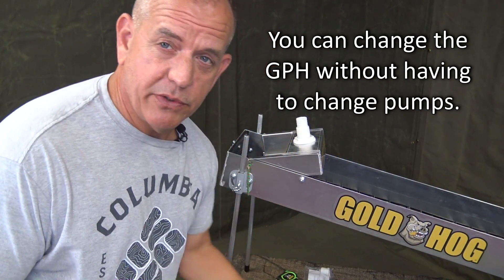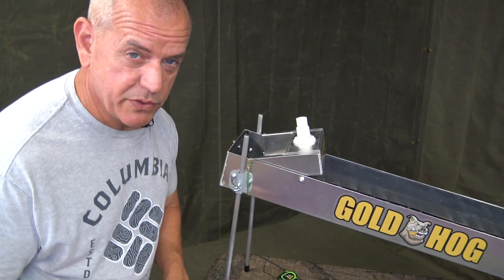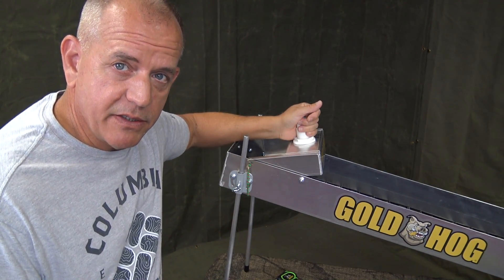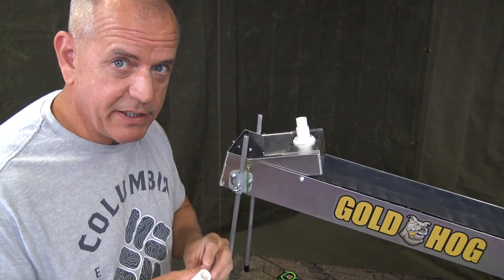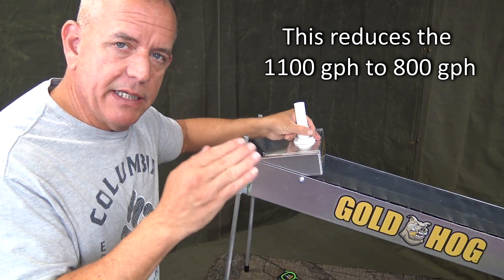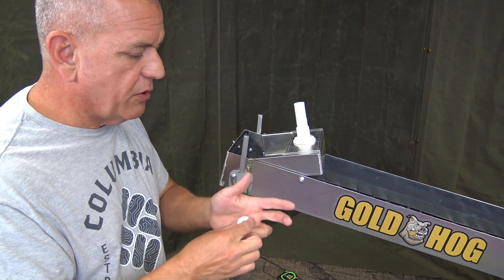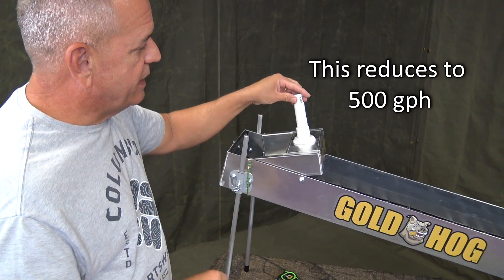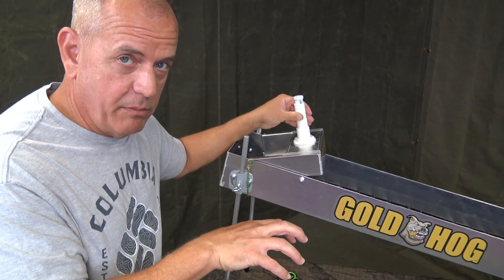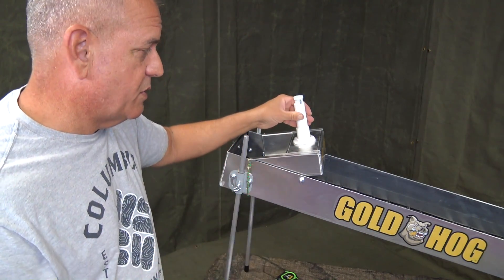What's also interesting about the system is the way that we converted the pump without having to use additional pumps. Basically, if you hook the 1100 GPH pump up to this, you're going to be running 1100 GPH. You can put in restrictor number one, and when you put this in and put the hose back on, it takes the 1100 GPH pump down to 800 GPH — that's where you run your washer mat. We also came up with another plug that fits inside and reduces the water flow down to 500 GPH. Essentially, you're taking an 1100 GPH pump and you've now got three pump settings — three restrictions — that you can change the flow on this. We have full instructions on this as well.